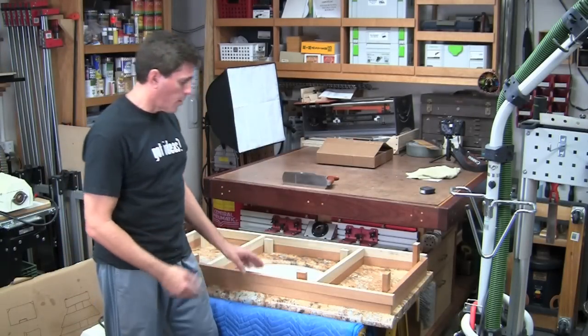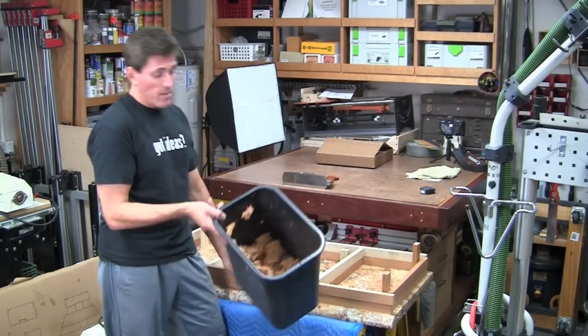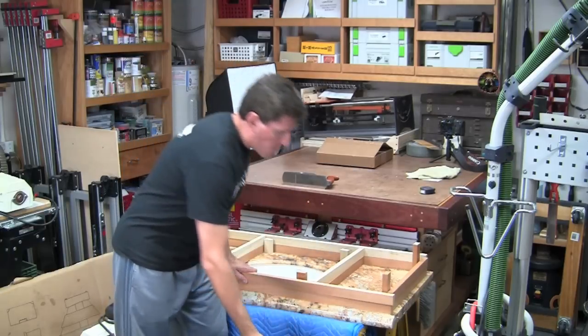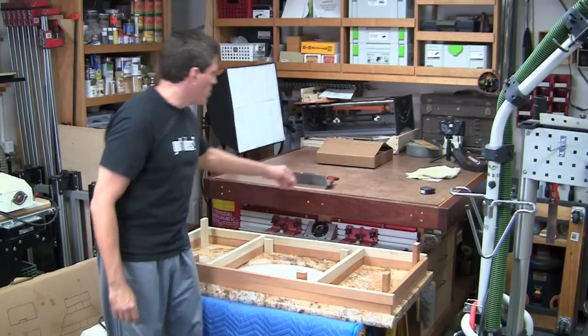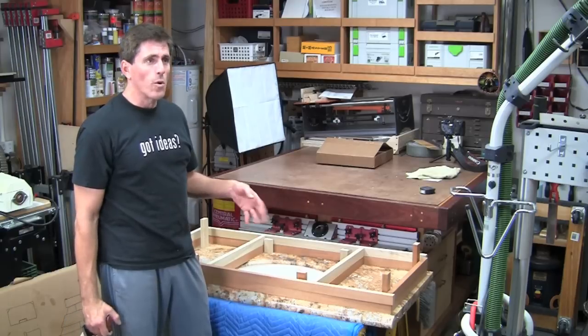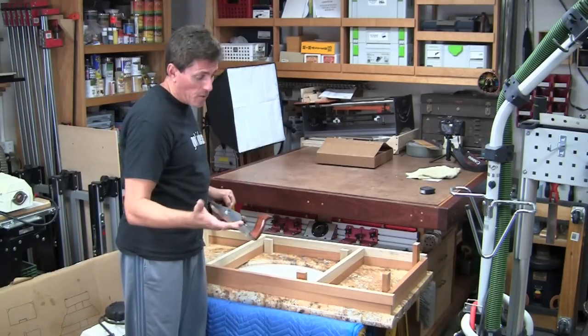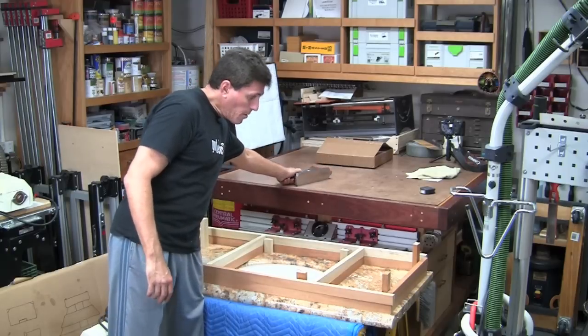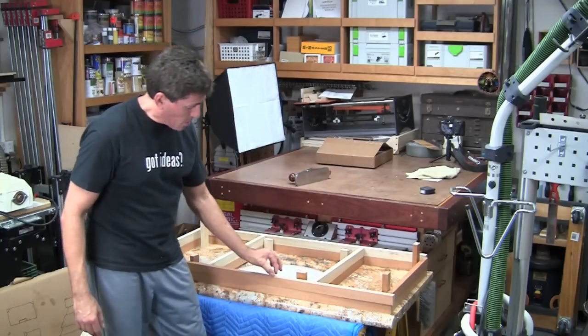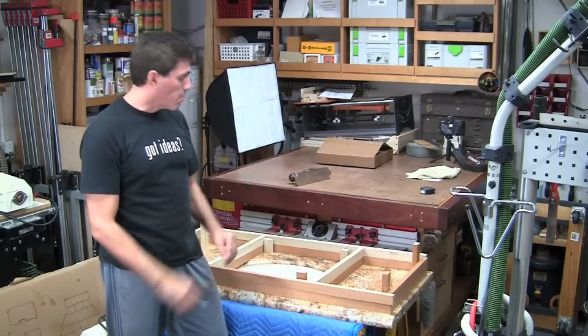All right — we got all the parts to size as we saw earlier, and I just went through and planed off all the machine marks. That's basically a bucket of machine marks. I find it's a lot easier to just hit it with a smoother plane — it goes very quickly, usually takes one, maybe two swipes at most. There was one with a little dip, which was nice to get flattened out. The edges become so much crisper and cleaner, so when we go to do the joinery with the dominoes, these are going to match up beautifully.